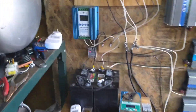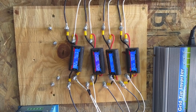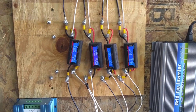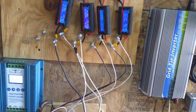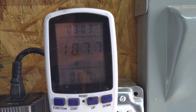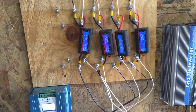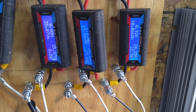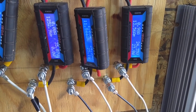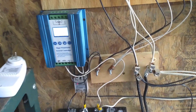As far as the controller goes, this has actually worked exactly the way I thought it would. It's keeping the battery voltage above 24 volts and it's cycling on and off exactly as expected. Right now there's enough wind that we're producing about 107 watts, but it's not great — we've got between five and ten mile an hour wind out there. It's not impressive. Things aren't getting hot so far.